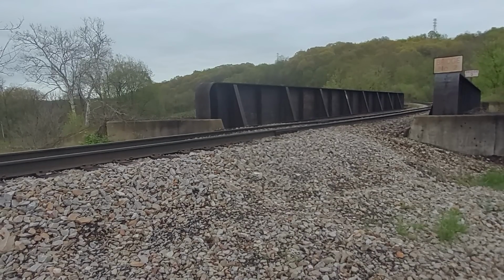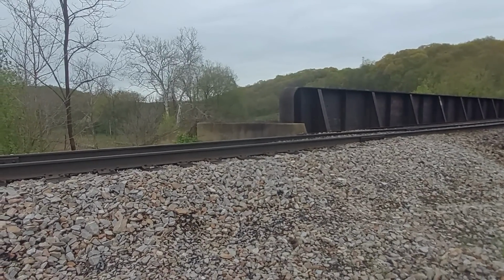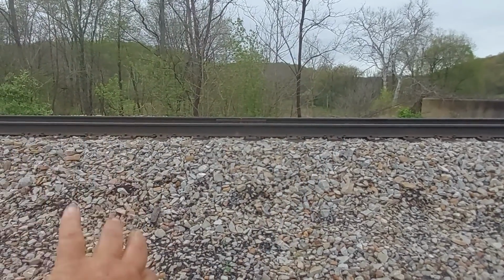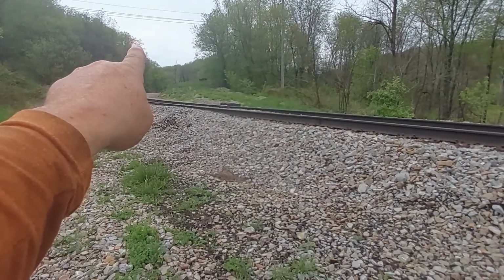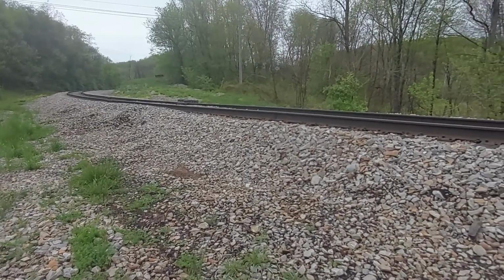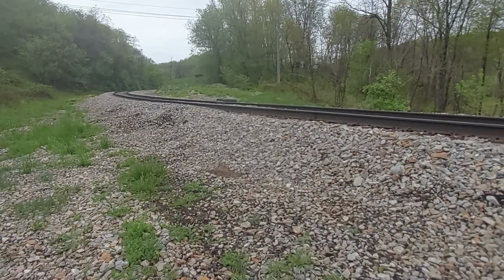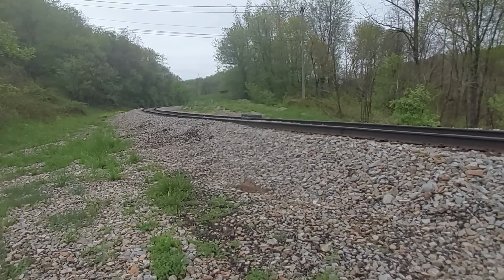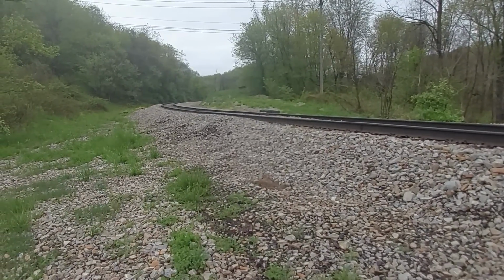So when you get mud track, you can tamp it all you want and dump rock in it and tamp it, and you've got mud. You're putting mud under those ties. So dig that mud out of that crib, get rid of it, so I can put a good rock under there, and I can hold it. Because you can dump rock on the mud like we tried up here in that really bad spot because my excavator was down. We tried that, and it just will not hold. You've got to get rid of the mud. And now we've got track surface that's holding really, really good, and will for a lot of years to come. So that's another cost savings that cribbing ties, getting rid of the mud, has for the company. I said, it's just totally cost effective. All right, I'll get off my soapbox now.